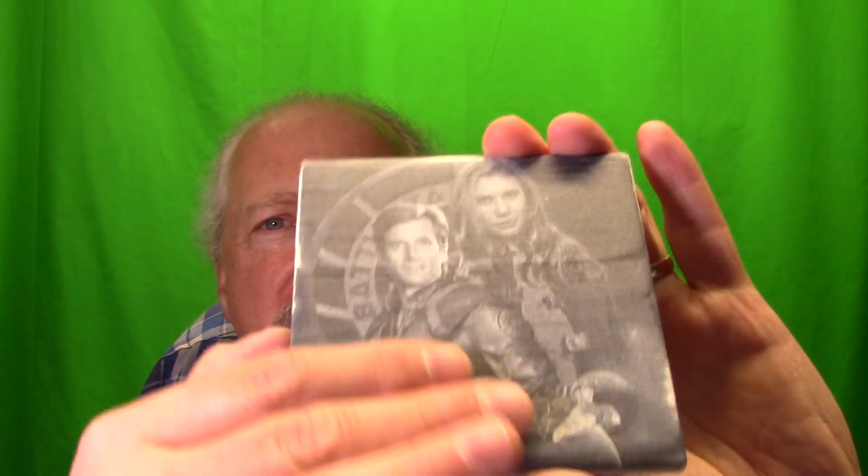I don't get those streaky lines like I do, even on this one, there's a little bit of that. I don't know if you can see it. There's a little bit of that horizontal streaking, and that's from how I was painting that on. Once I thinned out my titanium dioxide mixture with a bunch more denatured alcohol, it was much easier to apply. I got a much smoother coat, and I'm very happy with how that's turned out.